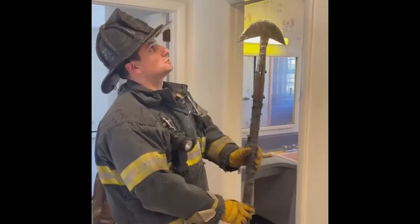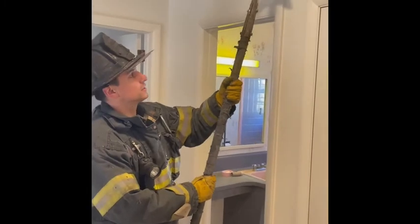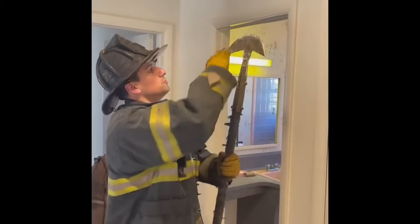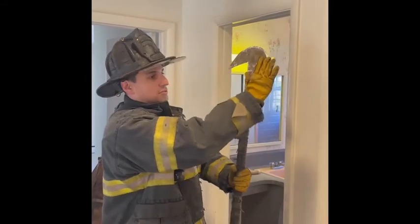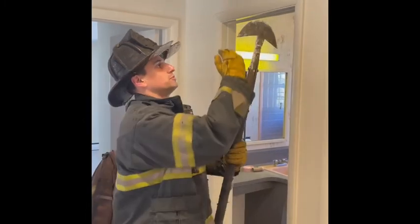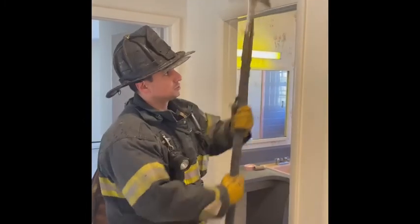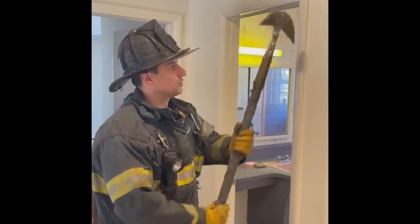The basic principle of using this tool is you bury it into your ceiling in a couple of strokes and then you turn it. You start with the footprint of the head — it's going to be a very narrow line — you get the head in and then you turn it, and now your footprint goes to that span, and you pull it down. That's your purchase point. From there, you overhaul as you normally would.